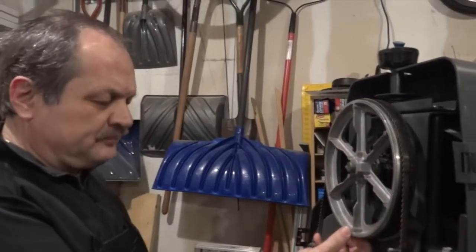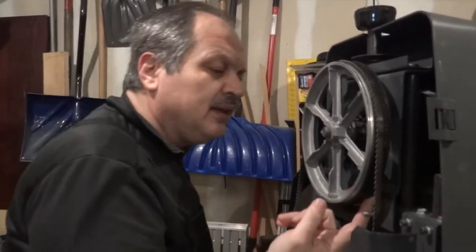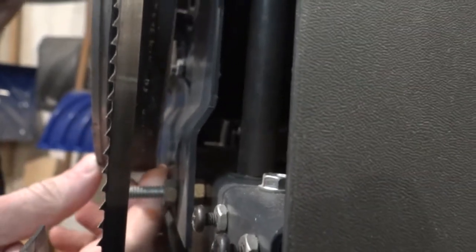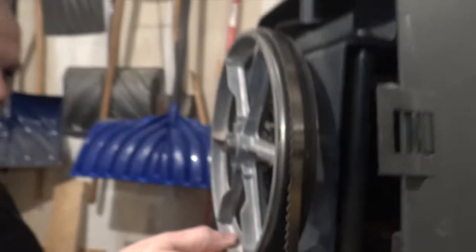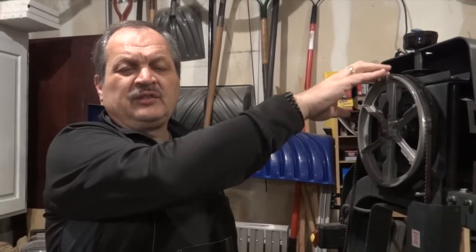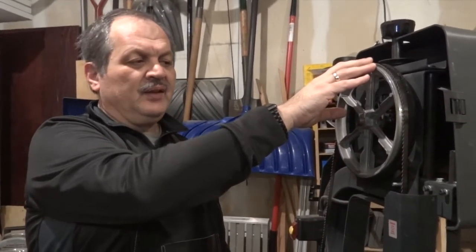After a lot of research and a lot of work, I found out that this tire is actually stretched and needs to be replaced. We thought the saw was burned because it actually starts smoking, but the reason why it starts smoking is that the tire makes contact at the back of the saw because it is too stretched — that was generating the smoke. This is definitely an unsafe condition to operate the saw. We tested it since and it works without problems, but if your tire tends to walk or slip off the wheel, that means your tire is too stretched out and it is time to replace it.